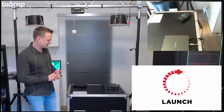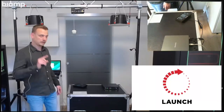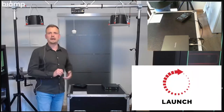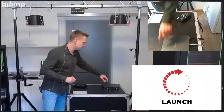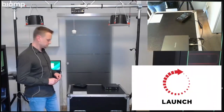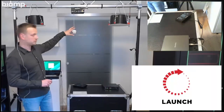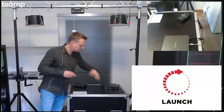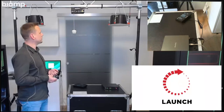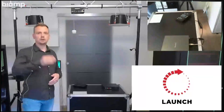It's time to test it. I'll press the Launch button — usually when you unpack and boot up the unit for the first time it will slowly flash green, drawing attention to whoever unpacks it. In my case it doesn't do that because it's already configured, but I can hit it again to restart the process. I have to hit it twice as a sanity check to avoid accidental activation. You'll notice it says: 'Welcome to BiAmp Launch, press the Launch button again to proceed.' Pressing it twice now — you see the microphone is turning off, it will reboot in a second. The launch LED is now flashing green and red — that means launch is in progress.